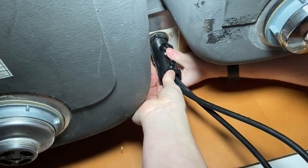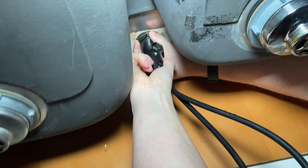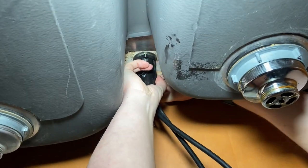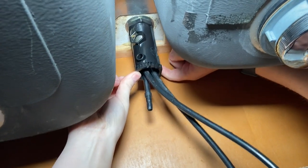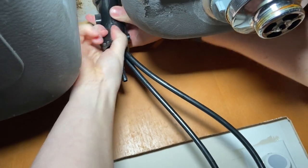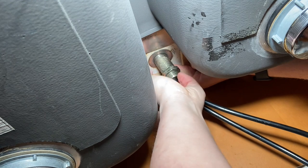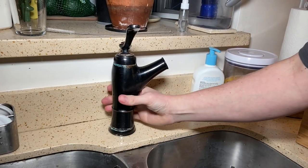That is now up on there. We're probably going to want a screwdriver because unless you can muscle that off — sometimes you've got to improvise, folks. My basin wrench got stolen and we're trying out a couple different things. Here's what we're going to do: he's going to hold down here and I'm going to turn the faucet. Turn left — okay, perfect. Got it! Always watch out for your face with any of these things — safety glasses are a good idea. Now you're just able to remove the faucet.